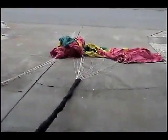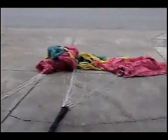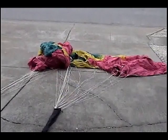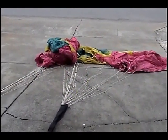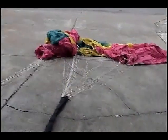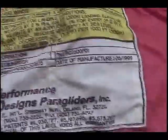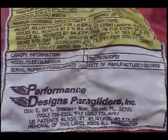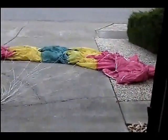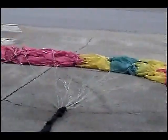Part of our inspection is to inspect the parachute, so we've laid it out and I'm going to completely lay it out so we can inspect the cells and the lines and make sure everything is in order. The owner mentioned he might have a couple of broken lines, so we'll check those. This is a Performance Design parachute and I'm going to get the serial number and date of manufacture off of it.